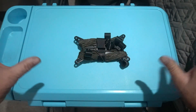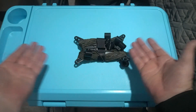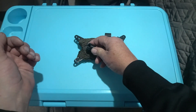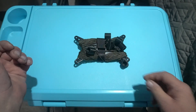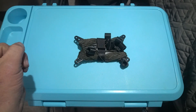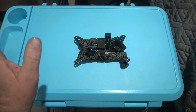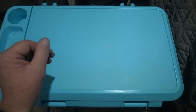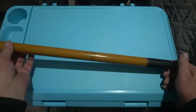These are the guy wires — they go out to each of the six arms in the hex beam. What these do is put tension on it to bring it up into that upside-down umbrella design. I printed these little pieces also — they go over the ends of the poles and each line is as close to the same length as I could get them. I did hook it up and it looked beautiful, but then it rained at my house for three weeks, so I'm behind. I only have three bands done.